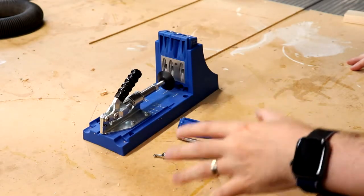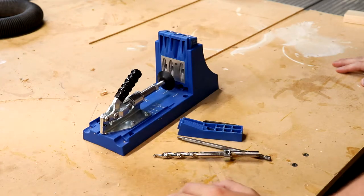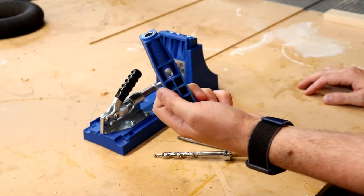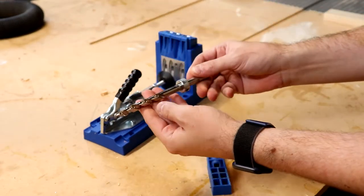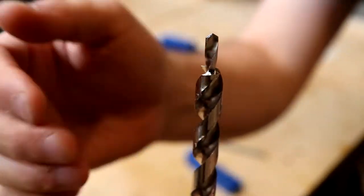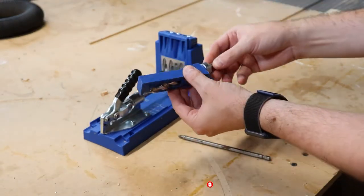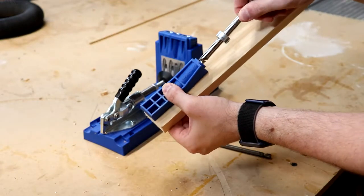This next tool is something I've used very frequently, and I would say it's pivotal to having a hobbyist wood shop — because it can get cabinets together really quickly and you can make really quick boxes. These are two types of pocket hole jigs, both made by Kreg. This cheaper one comes with a drill bit that adjusts via a collar to control the depth of your hole. The drill bit has a step to make a pocket for the screw, and you just drill right in and it makes a nice hole.